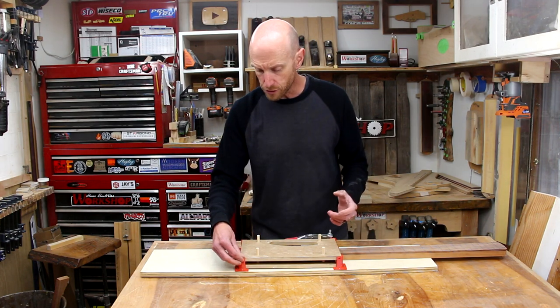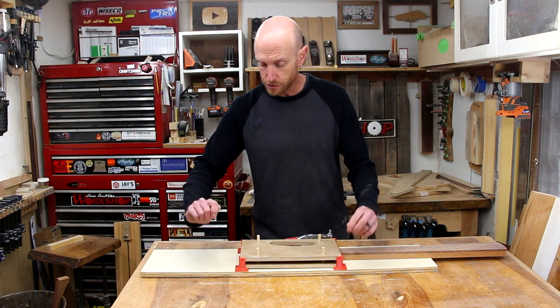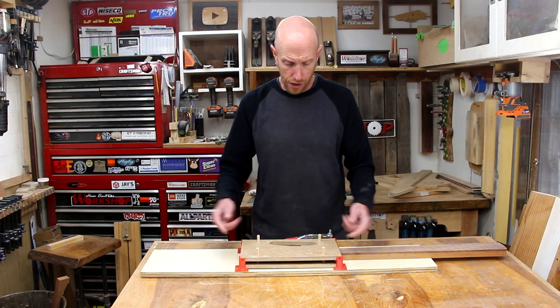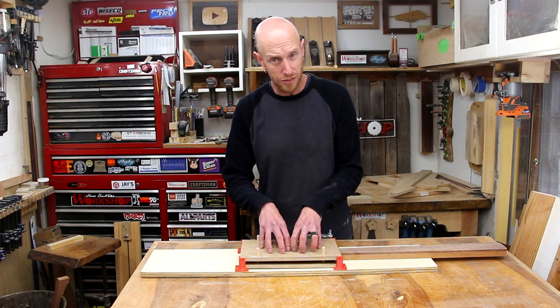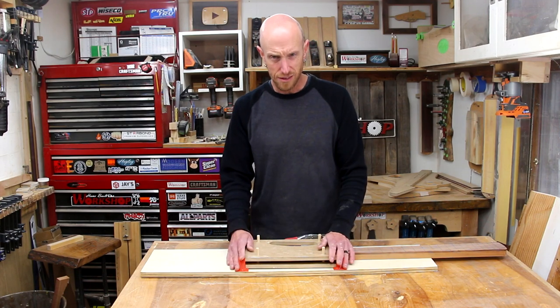And then on these little riser brackets, I have holes at the corners, and those are going to get tapped to use some thumb screws that'll tighten down just to make sure that this top piece can't move at all. And then once we have all that together, then I'll trim these dowels off below the surface of this top piece. That way the router can pass smoothly across here, and we'll test it.